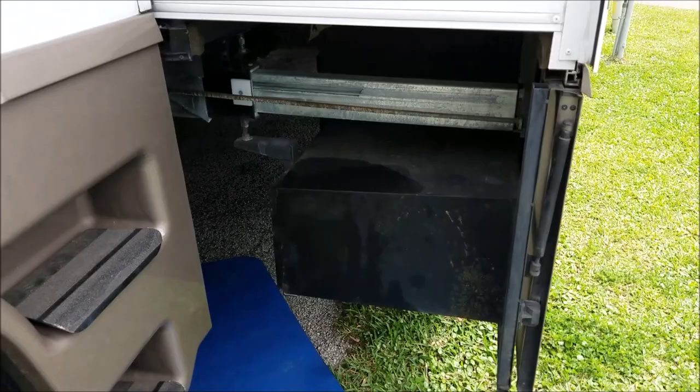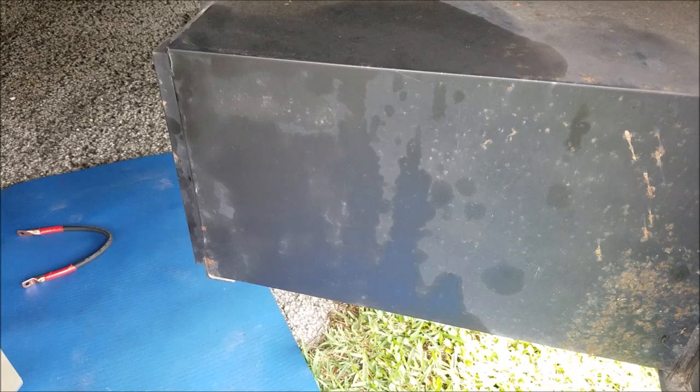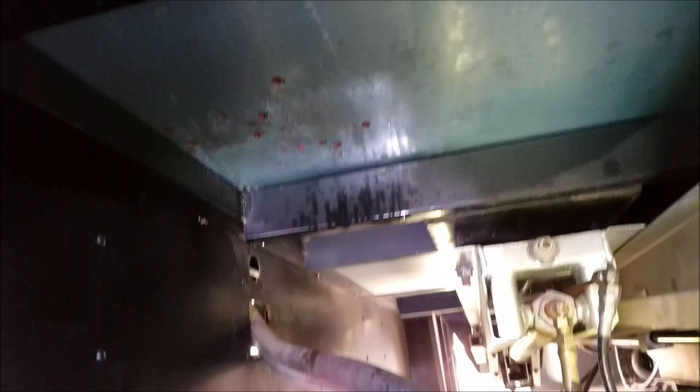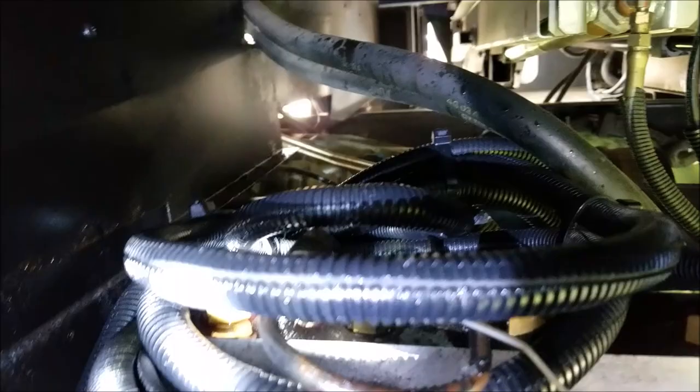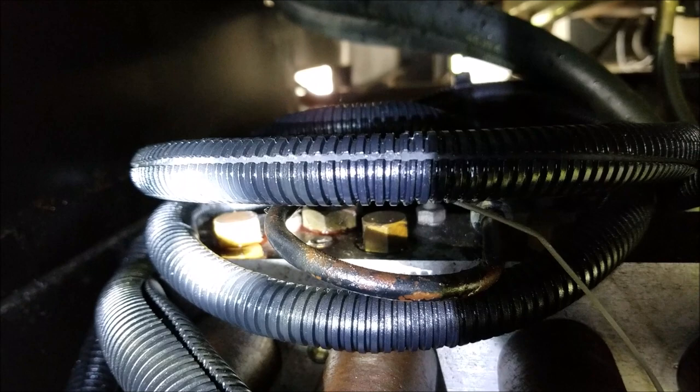Good morning. I'm down here in Orlando and I was walking around the RV just checking things out when something caught my eye - that oily residue I hadn't noticed before. I got to digging around and poked my head in here and I seen some oil up top - transmission fluid, hydraulic - and then I looked down and seen oil all over the manifold. Across the top we've got four check valves, kind of gold-looking caps, and I blew an o-ring on one.